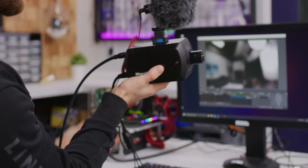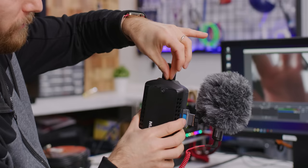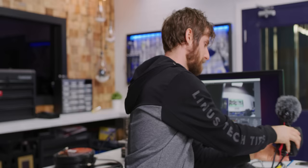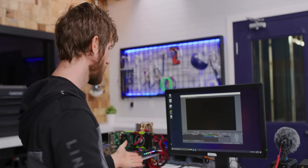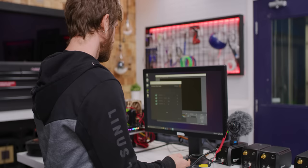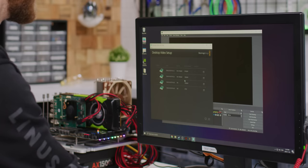But there are still some problems. Problem number one: even though these are first-party Marshall lenses, if I screw them in all the way, they are completely unfocused at every possible distance. Normally on a C-mount or CS-mount lens, there's a ring to lock the focus or zoom, but there is nothing that it locks — I can undo it as much as I want and there's nothing that turns. I have something booked with tech support to figure that out. For now, I just have to unscrew the lens in order to get it to focus. Problem two: if I go into the menu at 1080p 60, the Blackmagic card thinks I'm running in 3D. Let's do a factory reset — because we don't want to run 1080p 60 anyway, we want 4K.